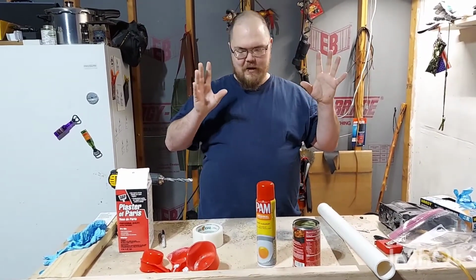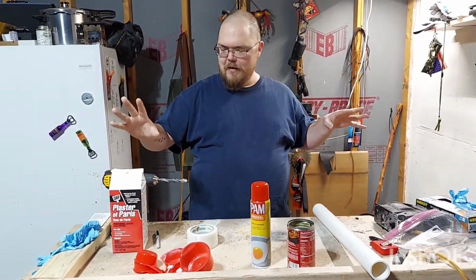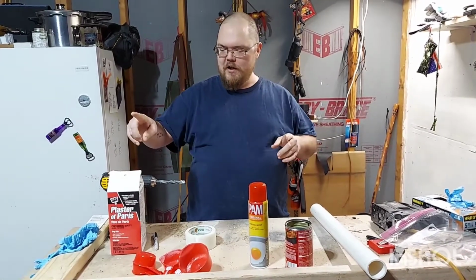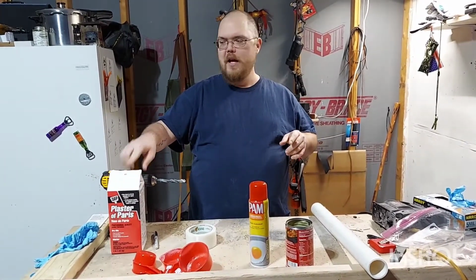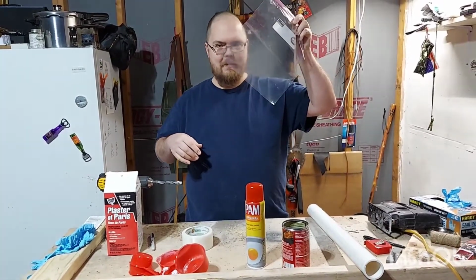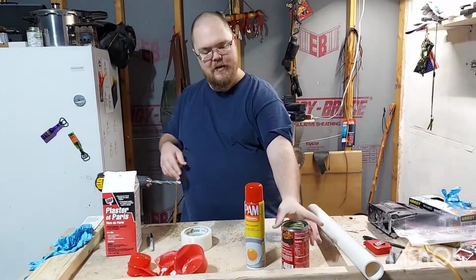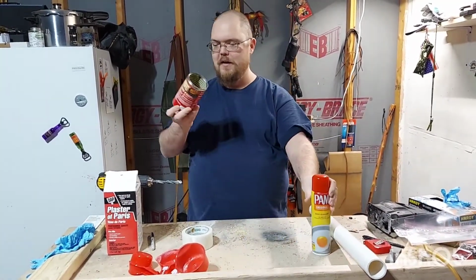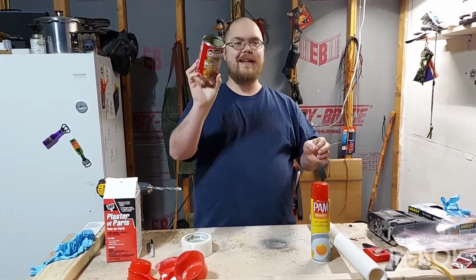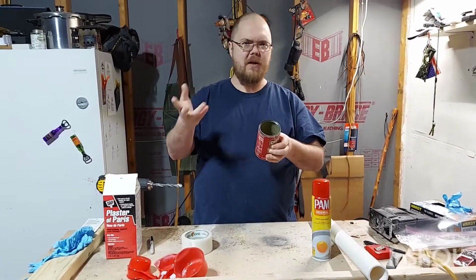Now, things that you need, it's a whole lot of different stuff. The forge itself, the insulation part of it, is going to be made from plaster of Paris, and then I got some sand over there. I'm going to mix it in a bag, just because I don't have a bucket to use. I'm going to be using a Campbell's Chunky grilled sirloin steak can, because I wanted it just a little bit bigger than like a green bean or corn can.